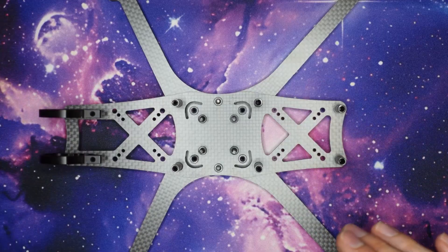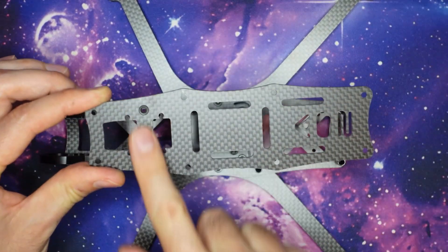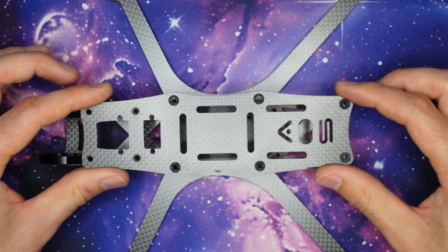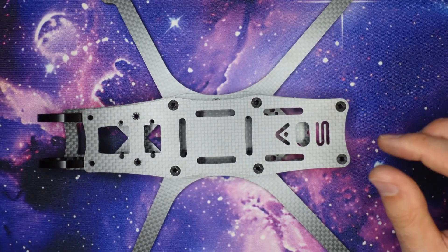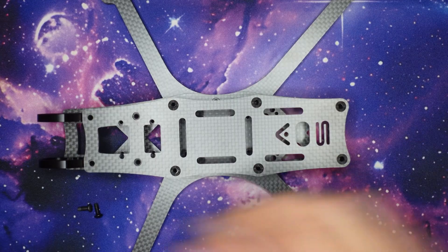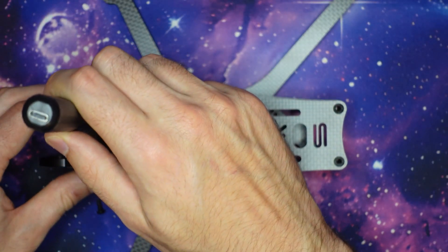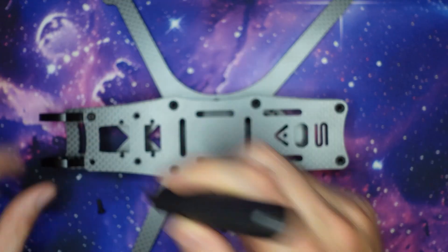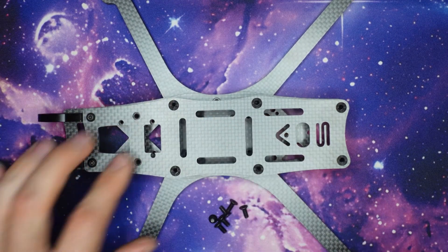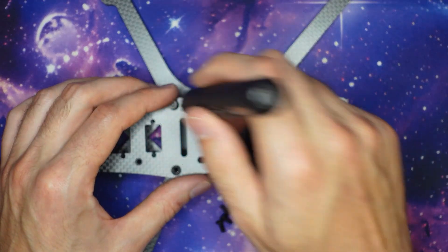Once the standoffs are all installed, the only thing left is to button up the top of the frame and install the standoff on top of the camera cage. Look at your top plate and identify the press nuts at the front — you want those press nuts facing down towards the bench and the countersinks facing upwards. To install the top plate you're going to be using two medium length button head screws for the two front holes and then six short countersunk screws for the rest of the top plate. Start by installing the longer button head screws in the camera cage and then do the countersunk screws for the rest of the top plate. All of these screws are threading into aluminium so just don't apply too much torque — just make sure they're nice and snug.